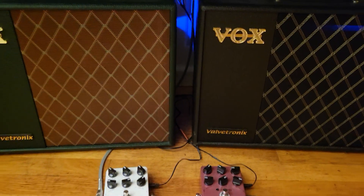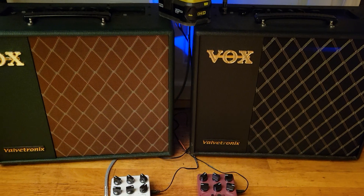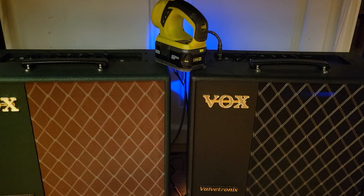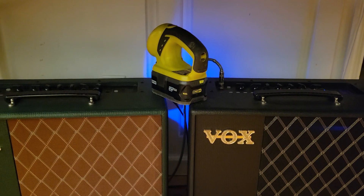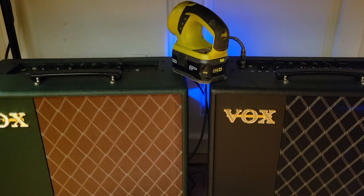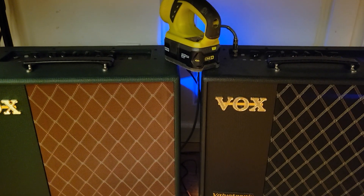As a side note, I also have this amp powered by a Ryobi battery. The Ryobi battery ranges from about 17 to 20 volts, which is the perfect voltage range for these amps. I have a little adapter that lets you get the positive and negative off the Ryobi battery, and I also took the same voltage and put it into a small DC to DC adapter to give me 9 volts so I could power my pedals from the same battery. I'd like a neater adapter, but it works — it's very portable and you can play for about seven to eight hours on one of these four amp-hour batteries, as loud as you want.